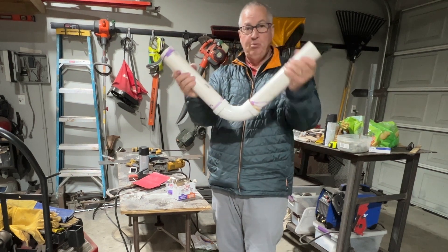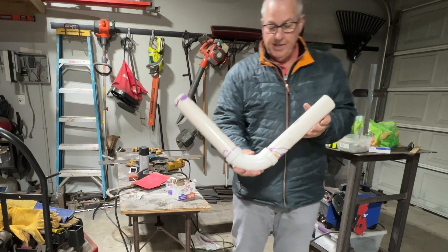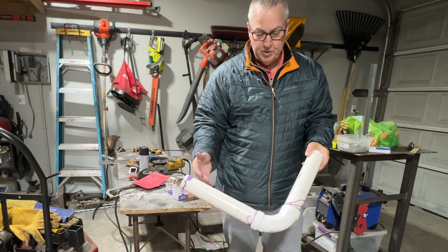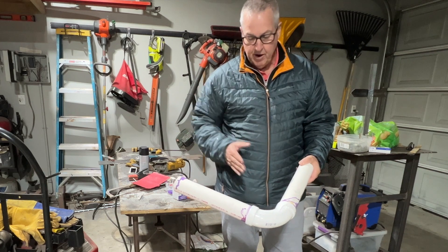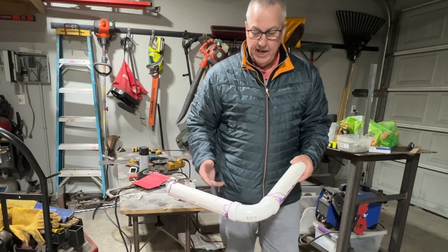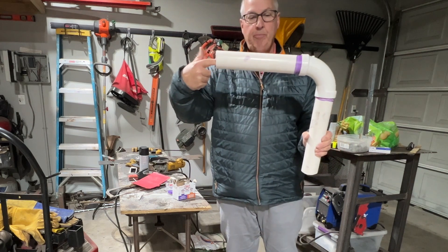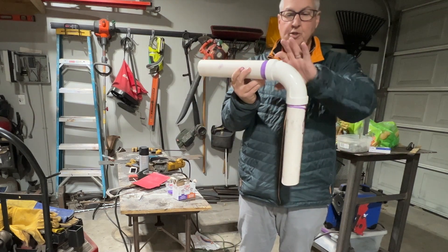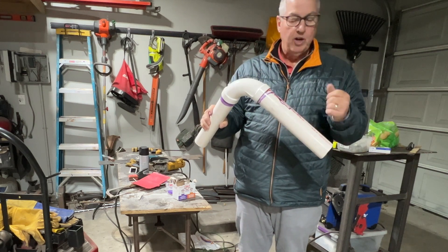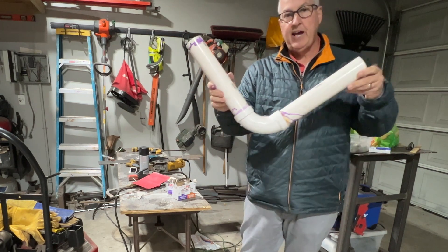That is how you put together PVC pipe with the cleaner and glue. You can see they're not moving. This is just going to sit on the corner — I've got a planting bed on each side and it's going to be concrete. I'll come back and cut this off if it's too long, and I'll just feed my irrigation through here and out the other side. Or if you want to run lights or any kind of thing under concrete — or if you've got a sump pump pipe and want to add an attachment — there's all different kinds: 90s, 60s, straight couplings, and reducers to take it from two inch down to one inch. Anyway, that's how you do it. Thanks for watching.